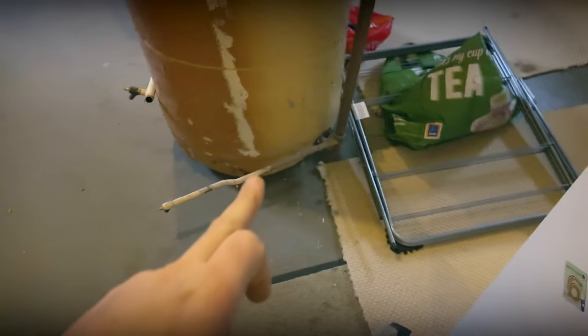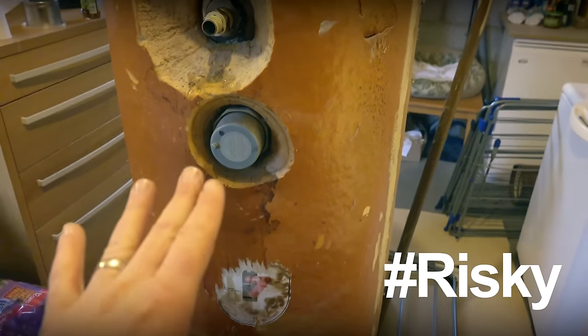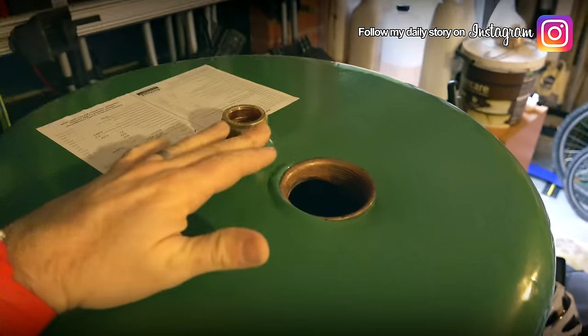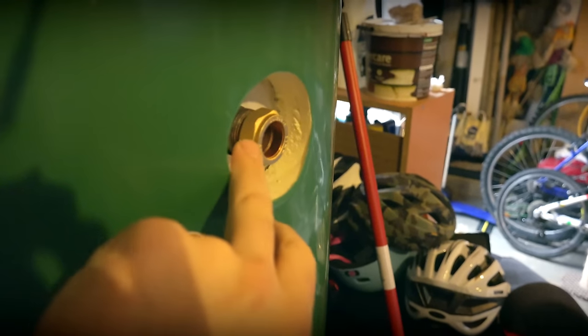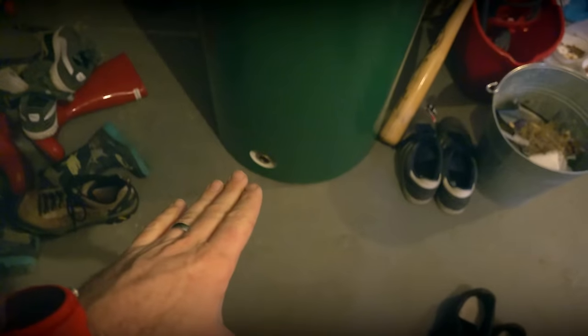Here's the new tank. At the top we've got a 28 mil outlet just there, and the immersion heater that we're just going to put a blank on. We've already got a flange on the side for our shower pump, so we don't have to worry about putting that in. Then we've got our coil flow and coil return. If I spin this round, we've got our cold feed down at the bottom there, which this particular manufacturer has put on the other side.